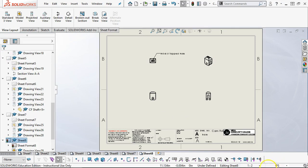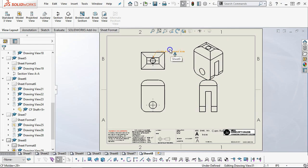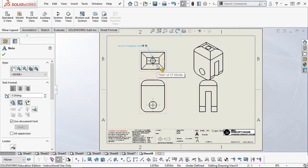So that one looks way too small. All right, so tapped hole. One of the things with this is the potential for rotation, that it could kind of unthread itself. So a future version may have a set screw that comes in from the side and captures the thread. There may end up being a lock washer. There's a couple ways to ensure it, and we could always just red Loctite the thing together.